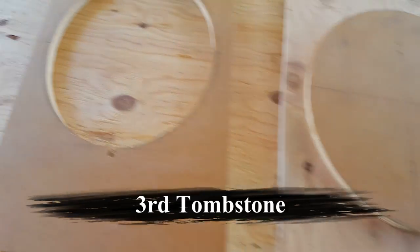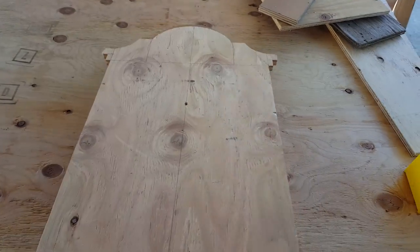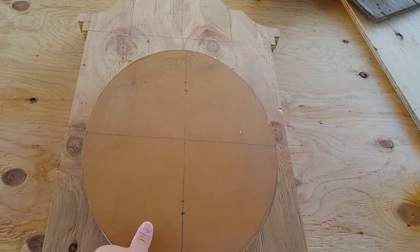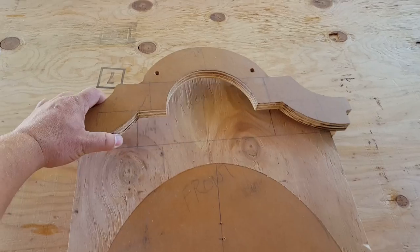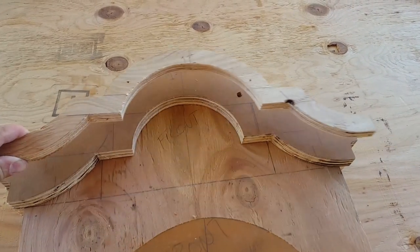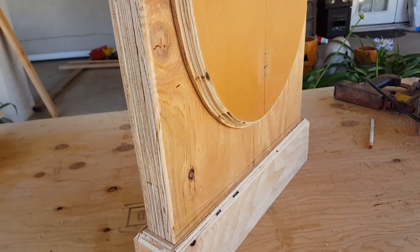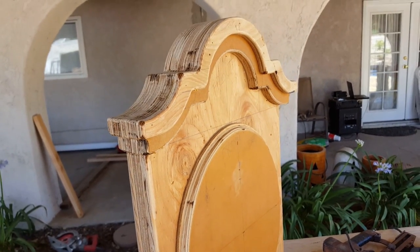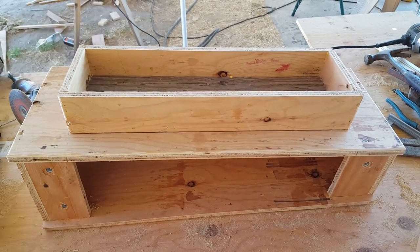For the third design, I used some MDO. Instead of cutting scrap pieces to go around the edge, I cut out a circle piece for the front and used that same cutout piece to fill up the middle. I traced successive pieces about an inch apart to build up the top, each piece getting thinner — about a half-inch — and it all gets filled in with mud anyway. Once cut and sanded, I glued and shot it all together. The base has a slight angle so the tombstone looks crooked — like tombstones in a creepy graveyard, or like the Michael Jackson Thriller video with figures crawling out. Crooked looks scarier.